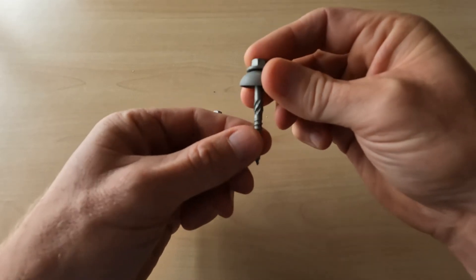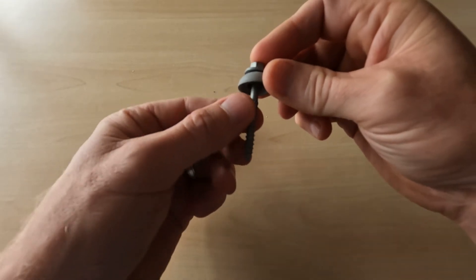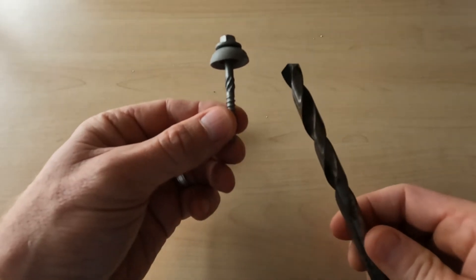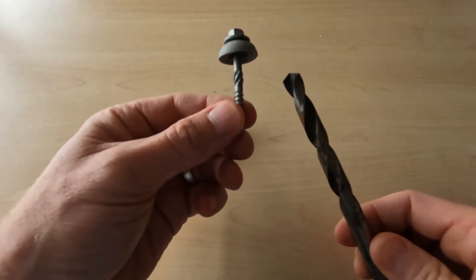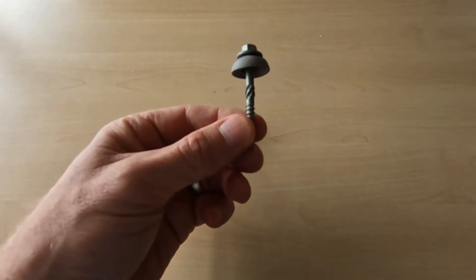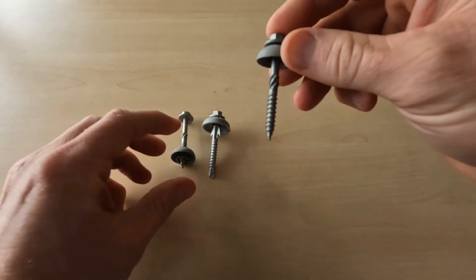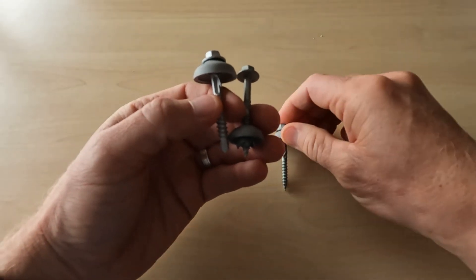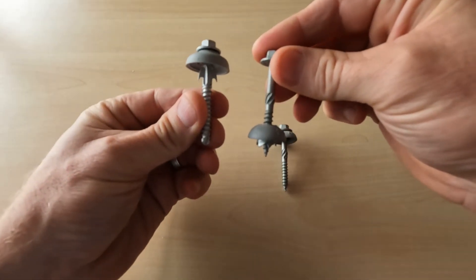This fastener here is quite commonly used — it doesn't have a hole cutter, so what that means is you need to use a drill bit to pre-drill an expansion hole first and then you can put this fastener through. For that reason we only sell the first two, because they're a lot easier to use — they just do everything in one shot.